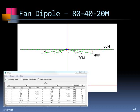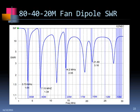The second antenna was a fan dipole. A fan dipole is simple — you have, in this case, three different dipoles all hooked together at common points in the center, with coax at the center and the three points coming together at a node with a feed line across it. The way the fan dipole works is that a dipole has a certain characteristic impedance, and the impedance at off-resonance frequencies tends to be very high, so the elements are effectively isolated from each other. You've got one leg cut for 80 meters, one for 40, and one for 20, and you get 15 meters along for free.